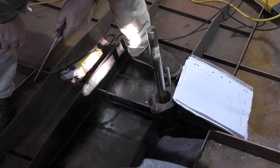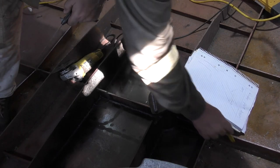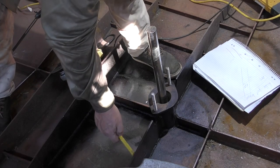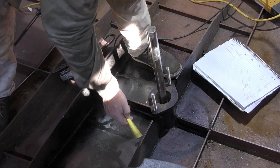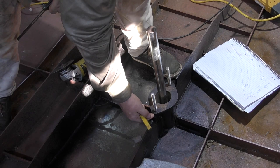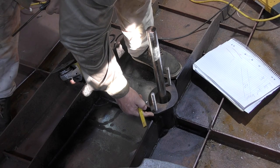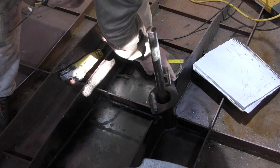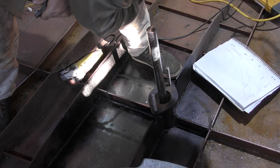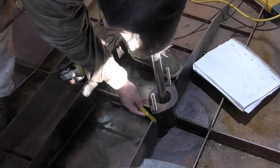I've taken the angles for the aft and forward ends of the braces, so I've cut these angles to get the braces to match up here and here. Fortunately, with these web plates the rudder post is just slightly proud of the web plates, so I'll be able to weld a brace directly on the side and put a good heavy weld on the ends of the lug each side. The braces will be welded on the forward side of the web plates, giving me a nice strong position for when I weld up all the way around.